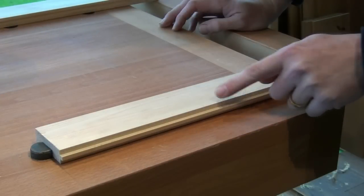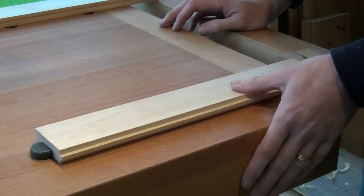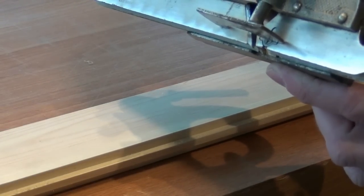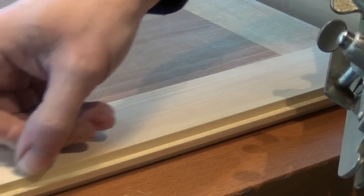The tongued section of work is clamped onto the bench. I'm using bench dogs here and the end vise. The beading gauge extends below the sole of the sliding section and provides a fence which is then run against the top edge of the tongued piece of work.